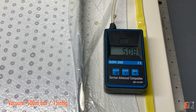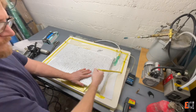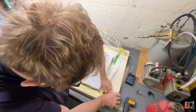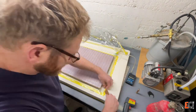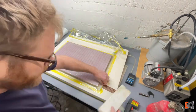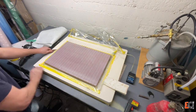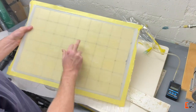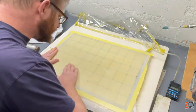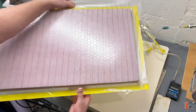On one edge of the foam panel, it got thinner. The uniformity of that XPS insulation is nothing special — you can see it right on that front edge. Here I am demolding it, trying not to break it. It's super easy to peel the skins right off. I've got a little wedge used for shimming in construction, and it's handy because it's a shallow wedge. Looking at the surface, there's a lot of kind of gross air, and a couple of places where the veil and the woven didn't meet up nicely.